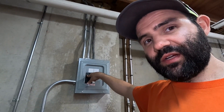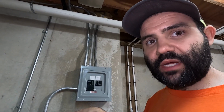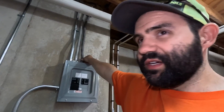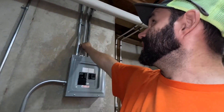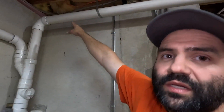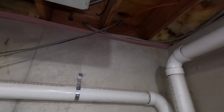I have a second 100 amp breaker for the main feed going out to the shop. Why? Because it was easy — this was already hooked into the panel, so all we had to do was hook a 100 amp breaker. Then we came back out with the same 2224 aluminum wire. You'll see it goes up here and over here, and then it goes through that hole. Let's go up to the garage and see where it comes out.